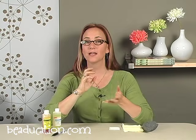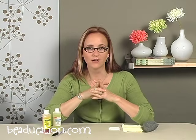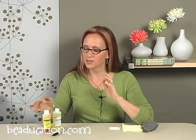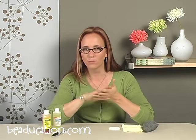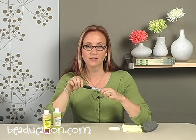Last but not least, we need a way to get the dark into the impressions so you get to see that contrast. There's a bunch of different ways you can do that. You can use these solutions, liver of sulfur or silver black, which actually react with the metal to cause the dark, then buff it away from there. We'll get into that. Or you can do the cheap and dirty way, like I do often, using a Sharpie pen or a permanent pen. What's nice about this is it comes in colors, so you can also add colors down into the impression.